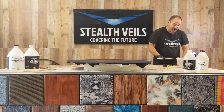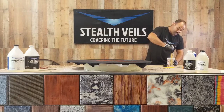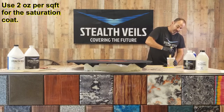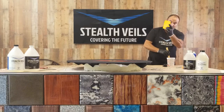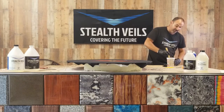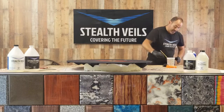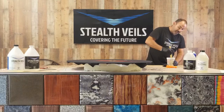On this layer, all we're really trying to do is get the veil wet out — nothing more than that. You're just trying to get it completely saturated, edges saturated. Then I'm going to use a Bondo squeegee to help move the resin around, and come back with our veil roller. This is important — that's going to get any of the entrapped air from under the surface out.